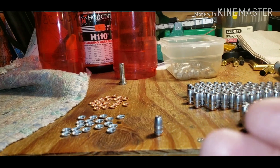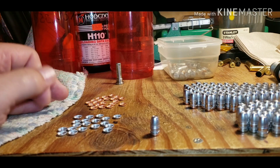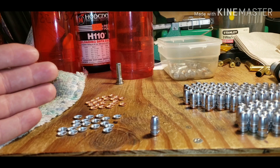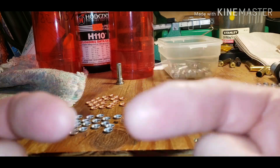This series will go on — this will be my copper versus gator versus aluminum gas check series. So far the aluminum ones are actually easier to work with than the copper or the gators, and the gators are easier than the plain copper ones. But that might just be this lot of gas checks. I improved things by sizing the base in my luber sizer first, then sizing in my Lee sizer, instead of clamping the gas check on and going straight to the Lee sizer. Alright guys, catch you in the next video.